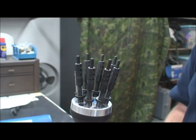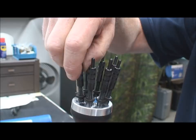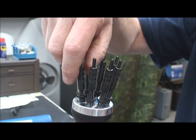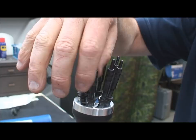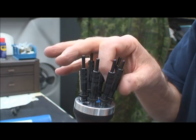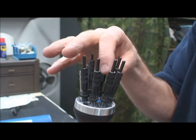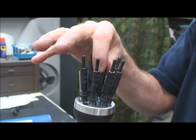That's a major shift — I think we got one more left — and there it is, the lock is now picked. I've only rotated it so the pick wires are now sitting on the flats. Now I go one at a time and tighten these screws down to set those wires in place and lock them down. The reason I'm doing this: if I just turn it one full rotation right now, all those pins will pop up and I'd have to begin again. I want to decode this lock so I can make a key, or use this pick as a working key.